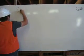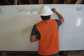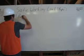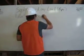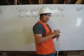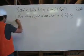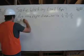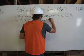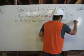To determine the safe working load for this three-quarter inch rope, there are four steps you must follow. First, put the rope diameter into one-eighths. In this case, three-quarter inch would be six over eight. Then, step two would be to multiply the top number by the top number, which would be six times six, which would equal thirty-six.